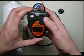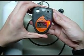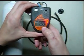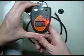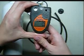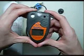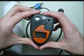Start it up — hit the big button on the center and it'll light up. As it starts up it'll give you the version number, the serial number, what gas it's looking for, the first alarm, the second alarm point, and then it'll go into mode. One nice thing about the Toxipro is how quickly it starts up. Also, if it does have a vibrating function attached to it, it will go off during the alarms.